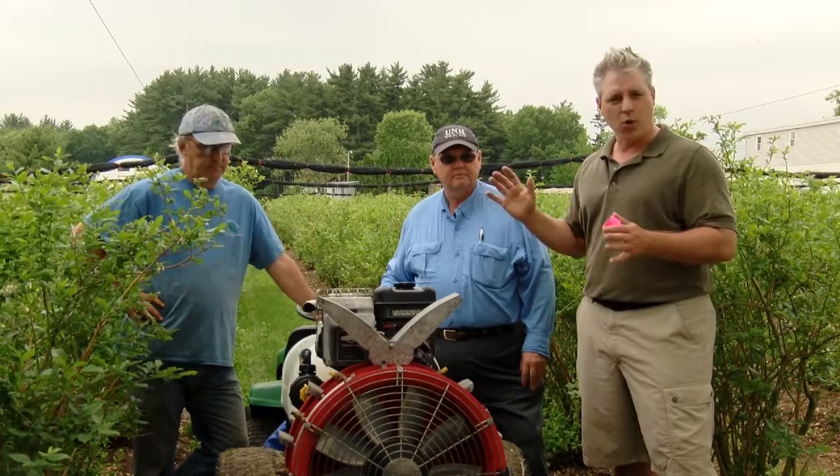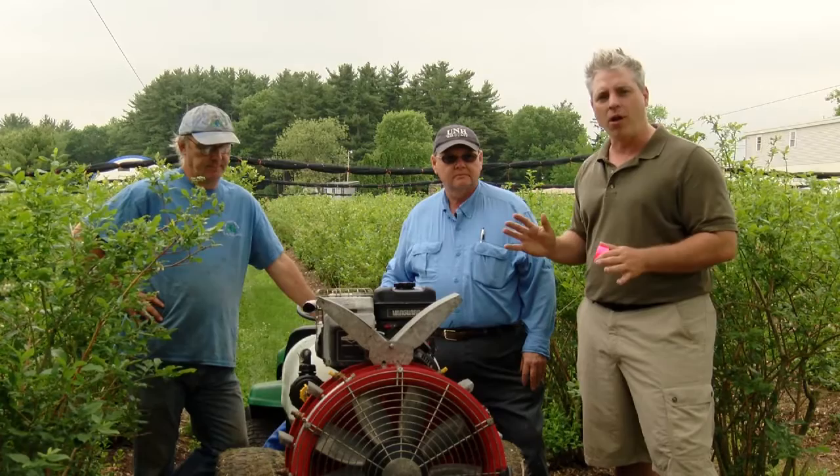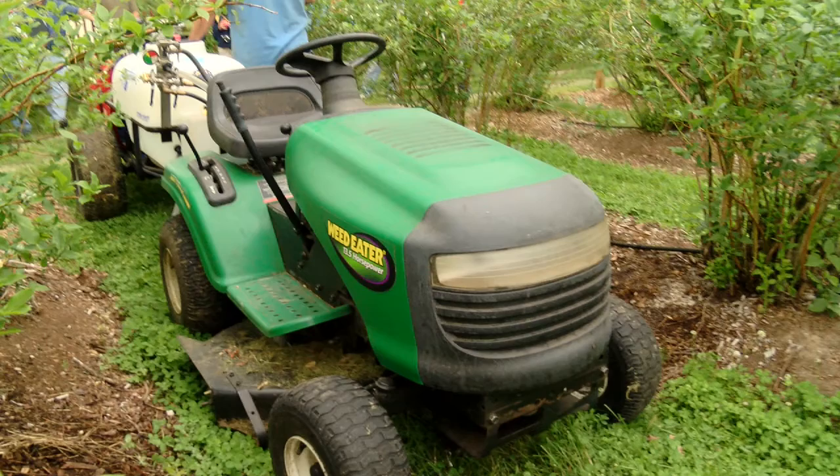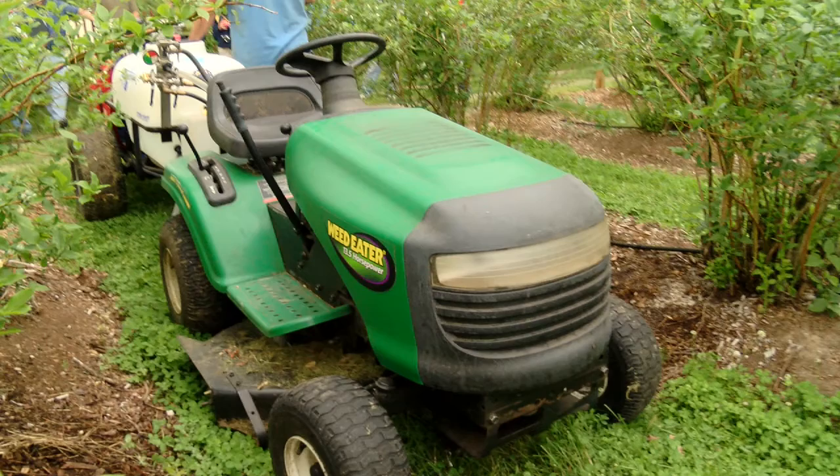This is a situation where the sprayer is just the right size for this crop. An orchard sprayer designed to spray to the top of a semi-dwarf is overkill — you end up spending all your time trying to choke back the fan speed, air, and volume so the droplets have just enough oomph to get into the center of the plant. But here, with this small fan diameter, the fact that it fits so nicely down every row, and the convenience of mowing as you're spraying, this sprayer is ideal for this situation. I couldn't be more pleased with the coverage we're getting.